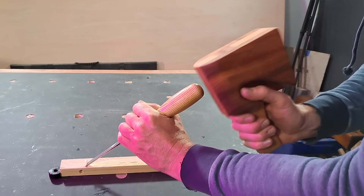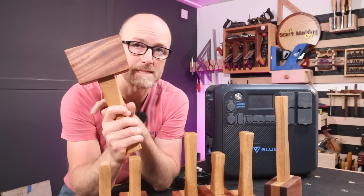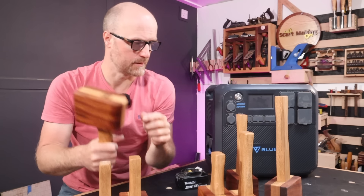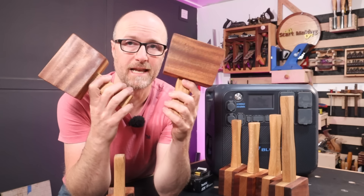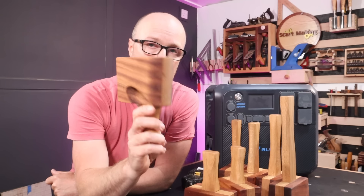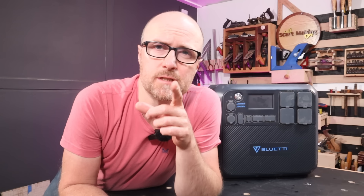Let's step away from the battery and talk mallets. That extra little thumb hole for using this for intricate work on both sides has made this my favourite little mallet. Long handle — perfect for walloping. Flat heads work best on a medium handle. The rounded heads at the front are lovely but the whole mallet becomes a bit back heavy due to the length of the handle. So if you're going to make a medium handled one, flat ends at five degrees works perfectly. For shorter handle mallets I think a larger head is absolutely fine, but I wish I'd made one a little bit smaller and lighter.